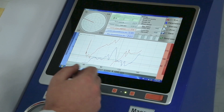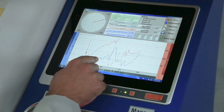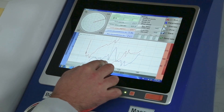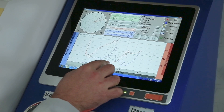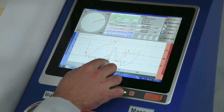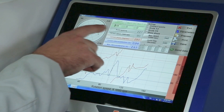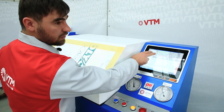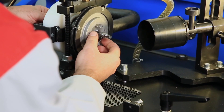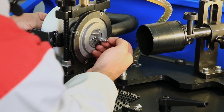How do we find the place where it bends? We look at the red chart and search on the blue chart. This is our first peak and the second peak. We are looking for the first third of the rise at the second peak — starting from this point and ending with this point. Somewhere right here we will have our provoker of imbalance. The angle shows the right arrow vector — the imbalance vector is on the right. Next, we open our protection. A label is installed on the turbocharger: we put this label vertically up and our imbalance — our provoker of deflection — will be right here on the right.